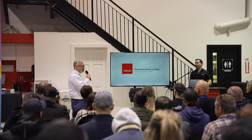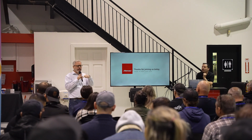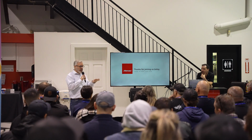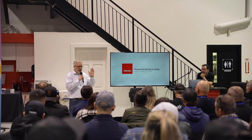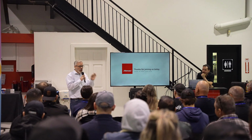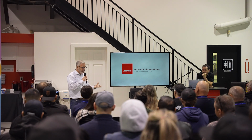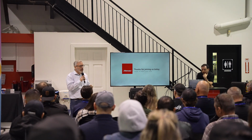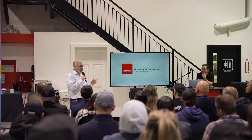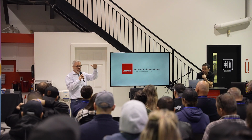And there were a couple of things I wanted to mention. I don't know if this got covered while I was looking for the part, but we talked about the titanium dioxide in the white ink. It doesn't matter what white ink you use, whether it's eco-solvent or UV or direct to film or pigments, they all have that in them, and that in itself will settle. That is just the nature of the beast, and that's why ink circulation systems are really important in these machines. But what Mimaki's done that's a little different from our competitors is we don't just circulate to the top of the damper.